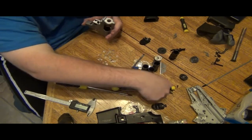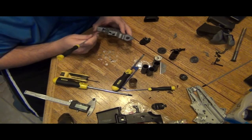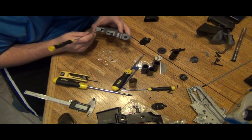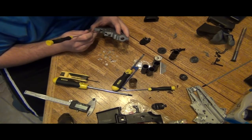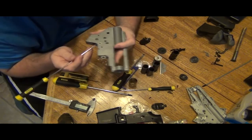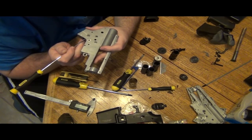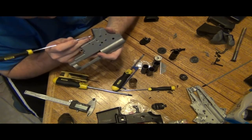Really see the gear moving back and forth, but it probably will once we check it. It can still go up, but it's only in the center of the bearing that it's moving up, so that usually means the bearing is moving because you're pushing it. It can't go up anymore with shims.